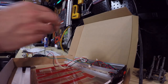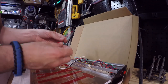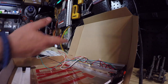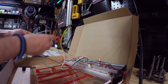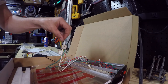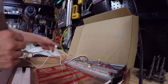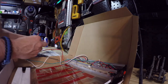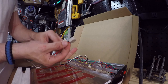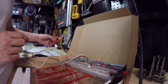With that being said, it says put the green and white together — so I got green and white together, and then I have my red and my black. What I'm thinking is you take this one and put these two together, and then these two leads run off to the power. What you do with red is you cap it and leave it elsewhere — so we're going to go ahead and cap it like that so it's not touching the aluminum or shorting anything out.